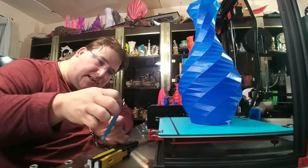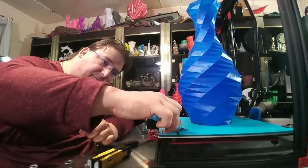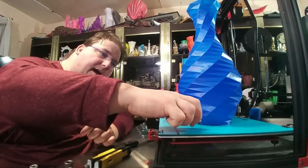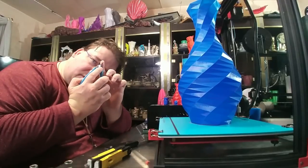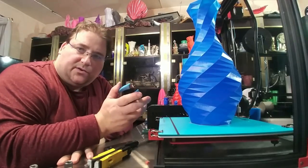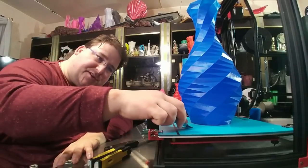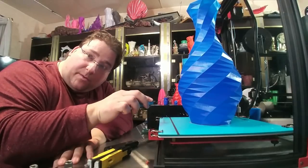What you do is you lay these cutters on the print bed so they're actually flush with the bed, so they're flat. You can feel they don't wobble anymore because they're flat. And you put it underneath the edge of the print and you give them a little squeeze and they actually go underneath the print. These will usually mar your print a little bit, but this is good for small prints that you want to pop off that are a little delicate. And what you do is you just nip it here and you'll hear it go. You'll hear that part of the print pop off.